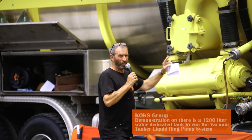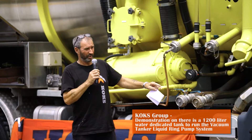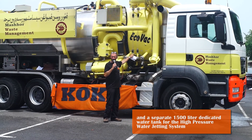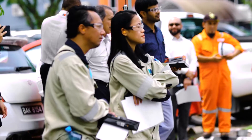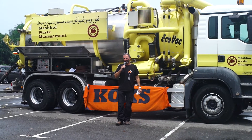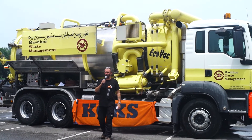What is also important on this machine, we also have a small high pressure pump. But we have a separate tank with clean water. So the polluted water, we don't vaporize it and have people inhale it. The water we use is clean water. We don't use the water from the pump because that can be contaminated with all kinds of products.